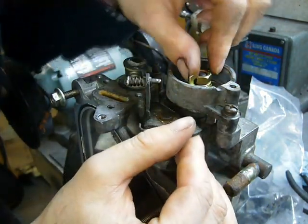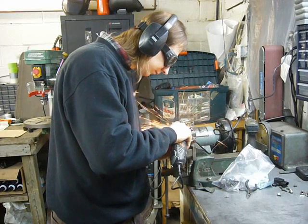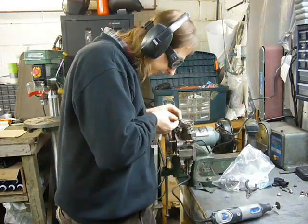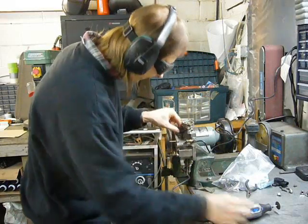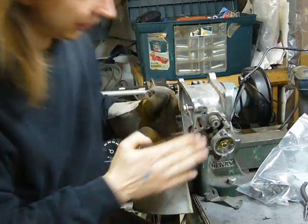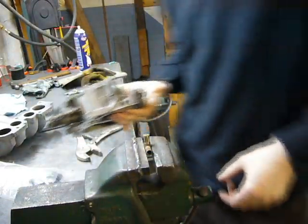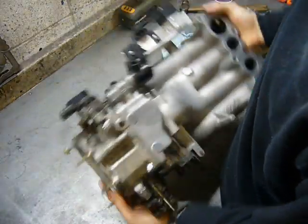This is in the way, but I really don't want to remove it because it looks like there's a ton of adjustments attached, so I'm just going to knock the corner off this with the Dremel. Might as well cut this thing off too. That was previously the bracket that held on the Cold Start Thermal Wax. I have the now-unnecessary coolant nipple clamped in the vise and I'm just pulling it out of the throttle body. Might as well save that.